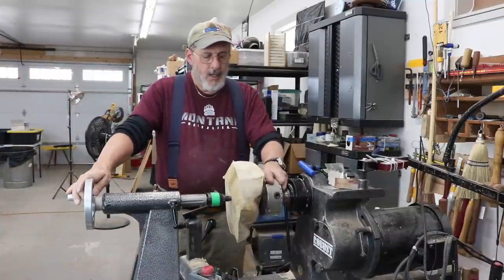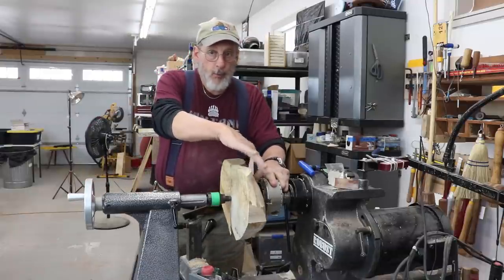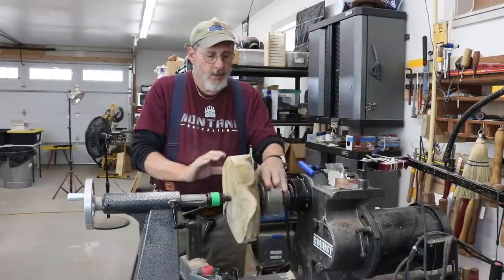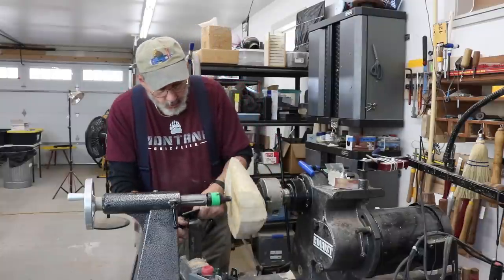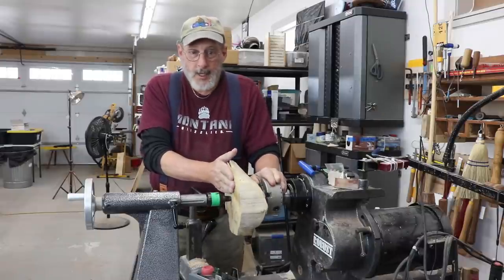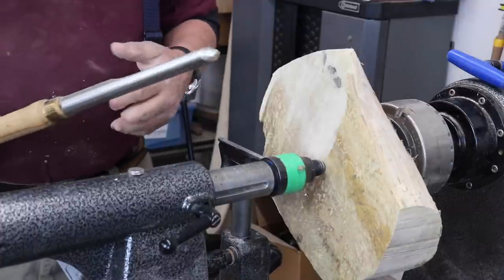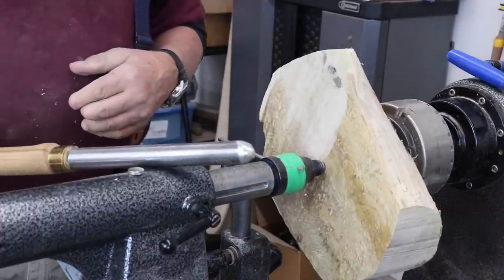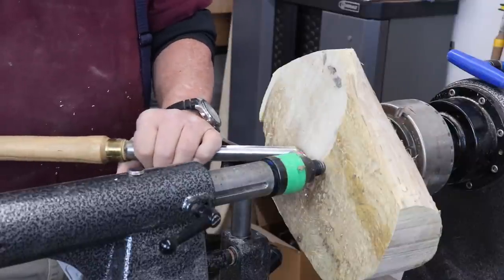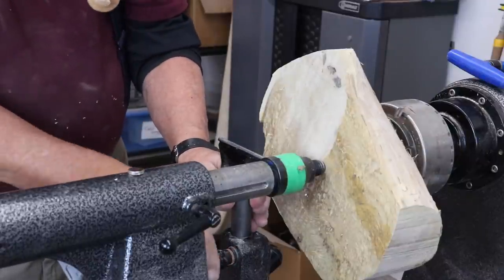I'm looking at this high point and this high point. I need to move it just a little bit. And even though that's screwed onto that screw chuck, I can still rotate my bowl quite a bit. I like that a lot. I'm not going to worry too much about the low points here because they're really uneven. So let's do a little turning on this. We'll start by leveling off this surface and go from there. Now I'm going to start off using one of my really big three-quarter inch bowl gouges.